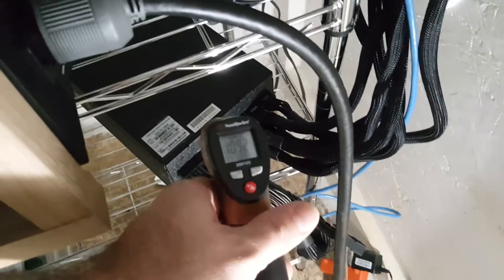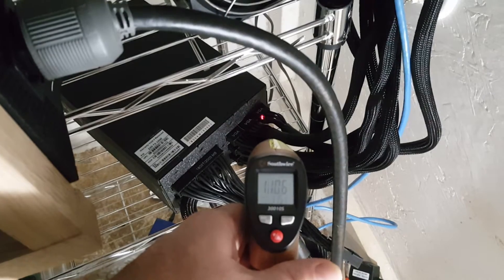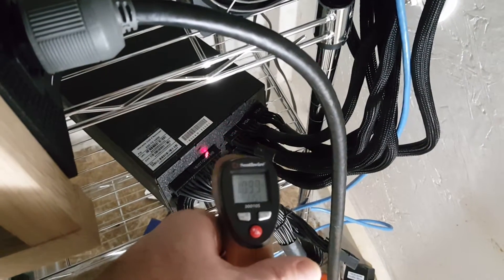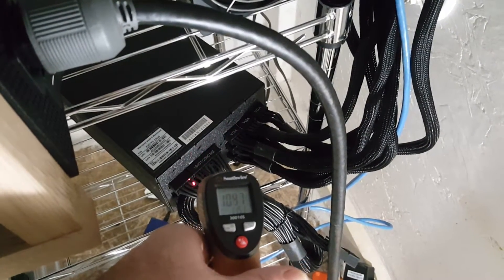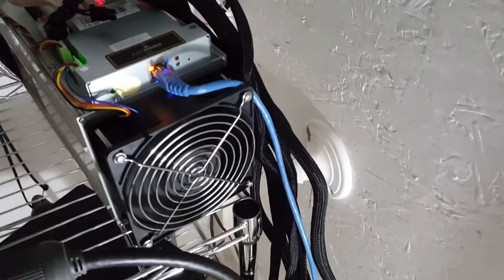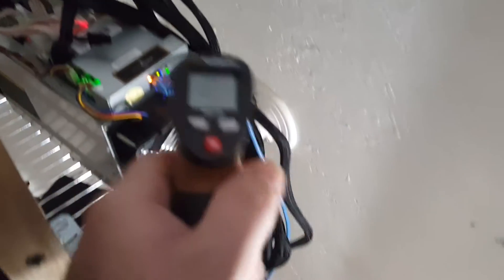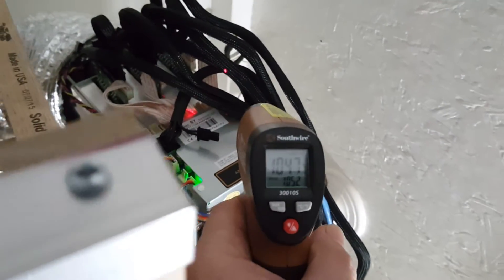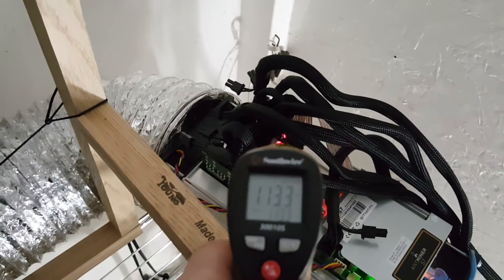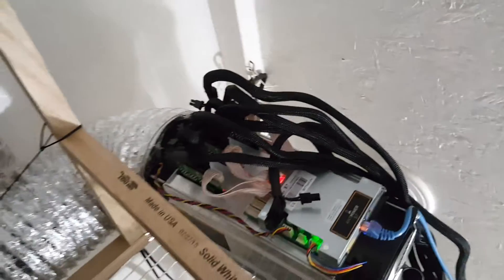So that's a different power supply. Let's check the power supply that this Ant Miner is actually drawing from: 114, 106, 108. Everything's all within tolerance. So if you guys start feeling warm wires, there's something wrong — you shouldn't be able to feel them warm. Everything I'm running in Fahrenheit, these wires are not getting over 103, 105, so that should be very lightly warm. Now the board itself — let's get the board: 114. About 114, so it's a little bit warmer.